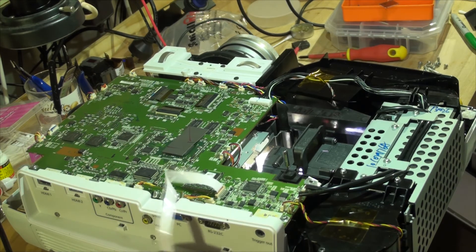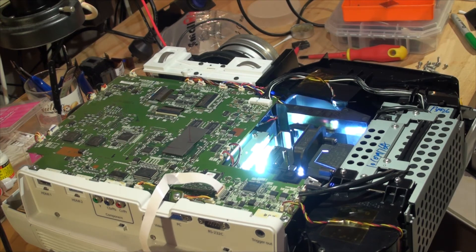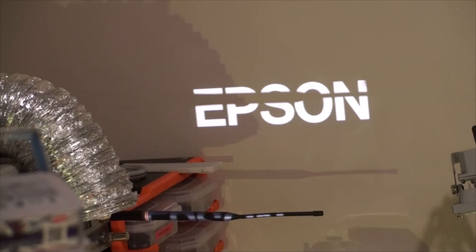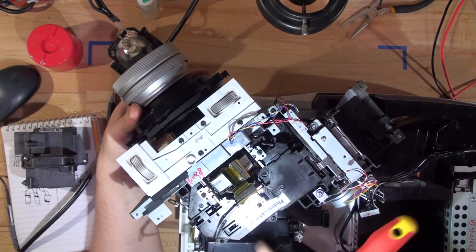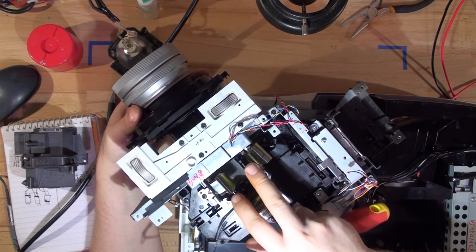Let's see if the image is okay. The image is okay but you can see a green glow around the picture, which is an indicator of a bad polarizer. So now we're going to open the engine up and have a look at the problem with the polarizer. The green tint means one of the polarizers on the prism assembly is dead or burned out.